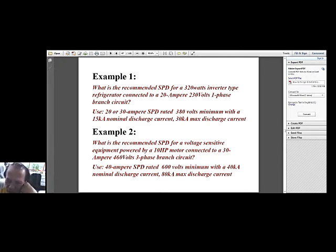No. The ground rod for the electrical system of the building should be different from the ground rods of the lightning protection system. And so with the communication system, it should also have a different ground rod. Take note of that. So usually in a building, there would be 3 different ground rods. Number 1, the one you use for lightning arresters. Number 2 is the one you use for your electrical system. And number 3 is the one you use for the communication. Okay? Number 4 question from Bunny.